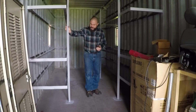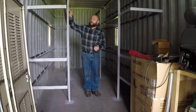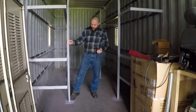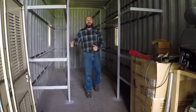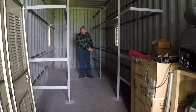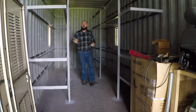When I welded the legs, I made sure to weld this one right above a metal rib that's going under the floor, so these will be able to carry a lot of weight without damaging the wood. I also welded a sheet metal over here to distribute the weight on the plywood so the angle doesn't damage the plywood. The back angle over here is already sitting on metal, and it happened to be right under a brace under the floor. So these also are very strong. The frame in general is very strong. I'll be able to put a lot of weight.